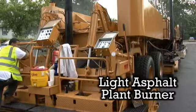You can then lift the screed 1 to 2 feet off the ground and light your screed burners. Stick the torch in the hole of the screed burner. Repeat this for each of the 4 burners on the screed. Let the screed burners heat for no more than 20 minutes, and then you can turn off all screed burners.